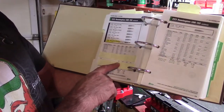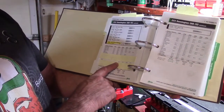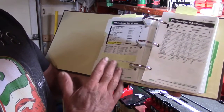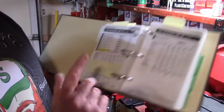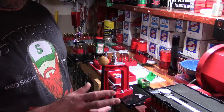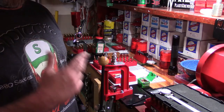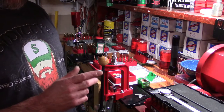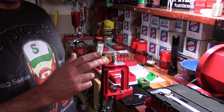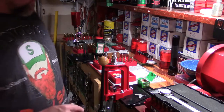Our built-in safety margin is we're starting low. If you overseat, you're going to use up your safety margin. I'll just throw a value out there — if you overseat by five thousandths, don't worry about that; readjust the die so you're not overseating. You'd rather under-seat and be five thousandths longer than five thousandths shorter.